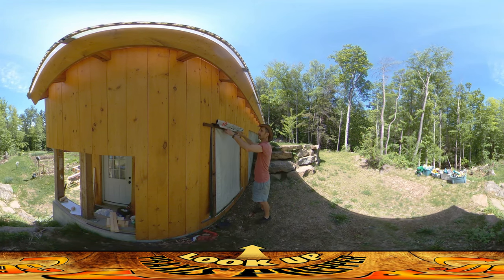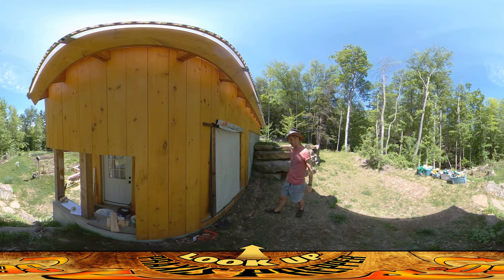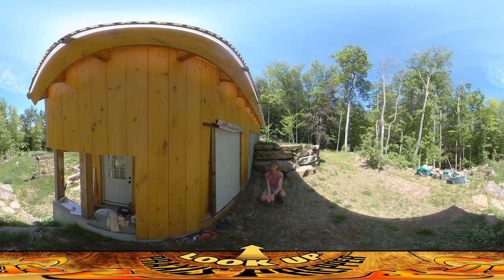I've just got a tarp on here with some battens to hold it down, and it's going to key right into this. It's three feet wide and it's going to overextend by a foot on either side so it'll be five feet wide. It's going to be three feet deep coming out over here. Instead of putting supports out in this area — my original plan was to sink in some concrete and have supports to hold this end — I think I'm just going to have it cantilever off the wall, which means it just overhangs. There's not going to be a ton of weight in there — I mean it's chickens, their water and food. We're able to grab onto the really strong posts on the other side of this wall, and with cross bracing I think that's going to be fine.